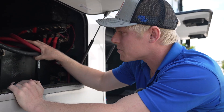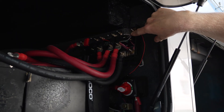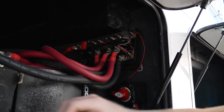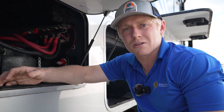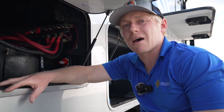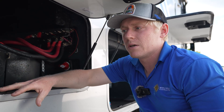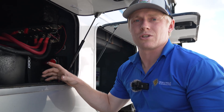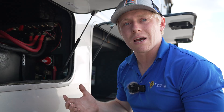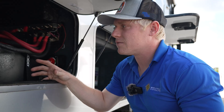Another issue is the way they've wired and fused the batteries. All the batteries are combined on a Lynx distributor, and the Lynx distributor holds mega fuses. Mega fuses have a small amperage interrupt current rating — I think it's about 2,000 amps. When you're using lithium batteries you really should have either an MRBF or a Class T fuse, as they have a much higher amperage interrupt rating. If there's a short circuit downstream that pulls more than 2,000 amps, the fuse is not going to blow — it's going to weld itself back together as it tries to open the circuit.